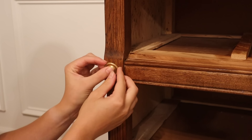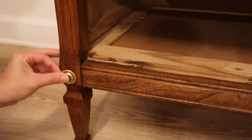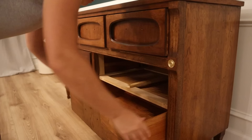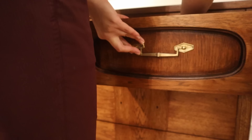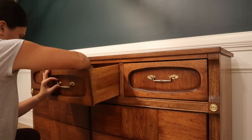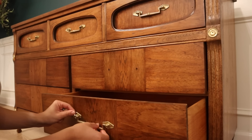I'm getting the decorative pieces put back on — I saved the little tacks, got those set back in, and lightly hammered them back in place. They fit just fine and were nice and tight. Then I got the drawers back in and it was time to get the hardware back on. Here's my trick for cleaning hardware: I take it all inside, fill a big bowl with the hardware, add baking soda and vinegar, boil water and pour that over it, let it sit, then scrub with rubber gloves, a toothbrush, and barkeeper's friend. Rinse and they're shiny as new.